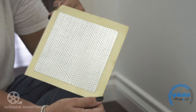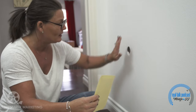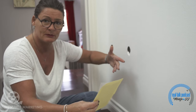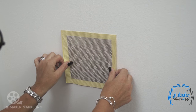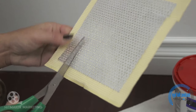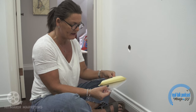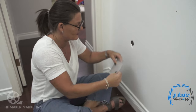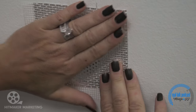It's a six-by-six patch metal mesh that has an adhesive backing, so you just peel that off and stick it on, and then we're just gonna put the mud over it. When you're putting it over the hole you only want about an inch overlap. You don't have to be perfect with this — the main thing is we cover the hole. So we're just gonna take that sticky backing off, expose the adhesive, and pop that on the hole and press it down.